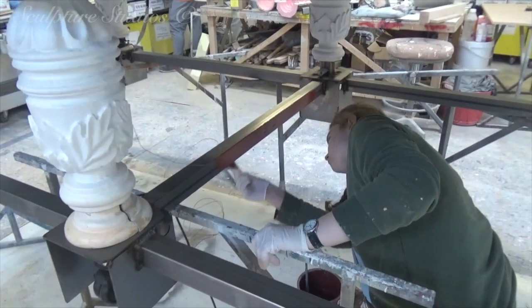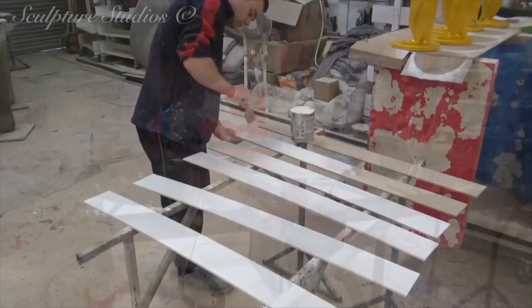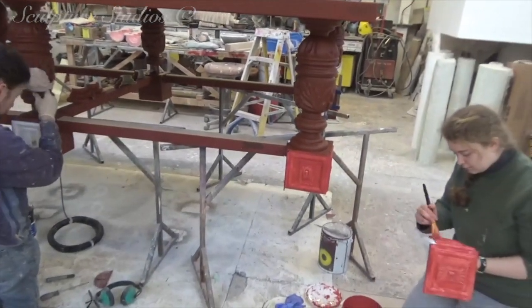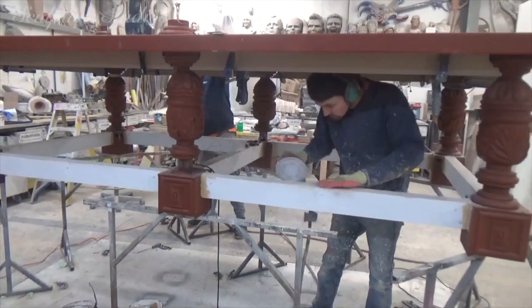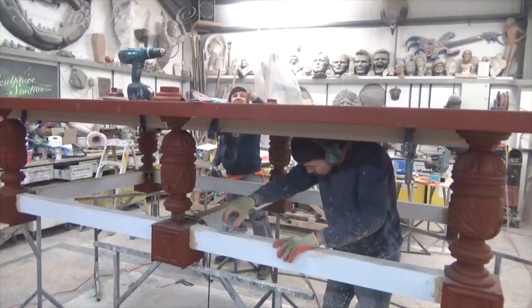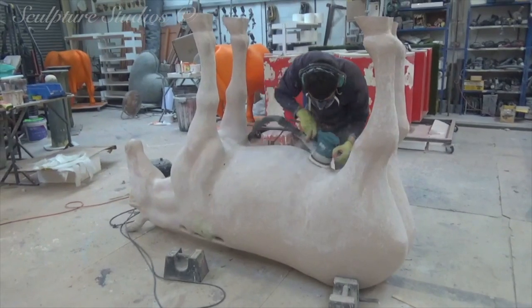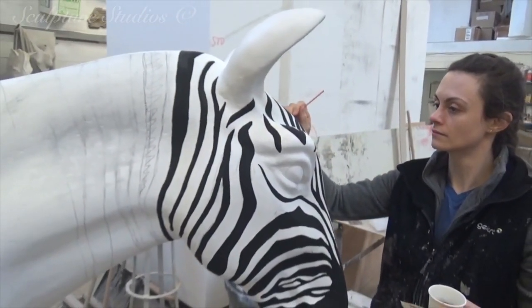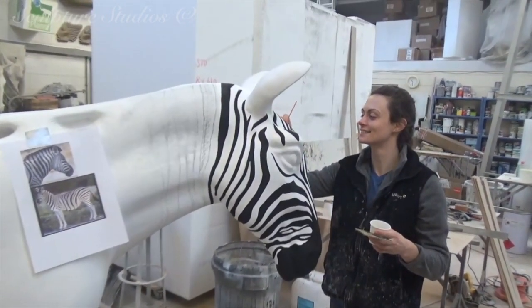The red oxide paint here is doubling up as both a rust protection for the mild steel as well as a base layer of colour for the artwork. We still need to install extra cladding to the frames to make it look as though the entire table is made of wood, and there's still a lot more work than first meets the eye. Between cutting the metal, cutting the wood, pre-drilling all the holes to attach everything together, having plates laser cut for the boxes on the floor, welding everything together, prepping wooden panels and screwing these on — we actually do have other work on in the studio as well. Remember when I said there were a lot of specific requirements? Well, these are all the things we need to pre-empt and plan for when providing the initial quote and determining if we actually have enough time to complete everything in keeping with the client's deadline.